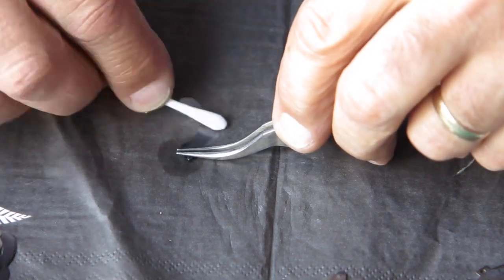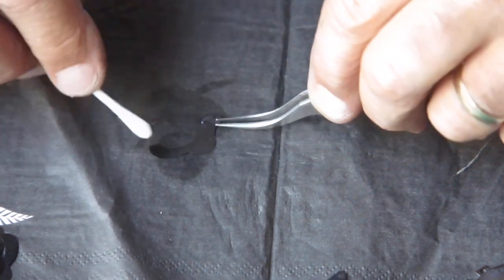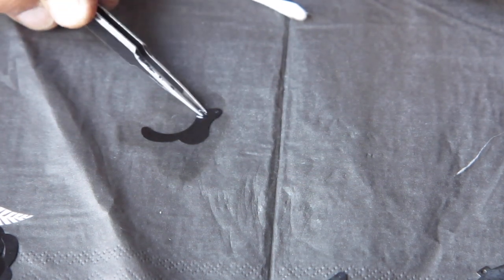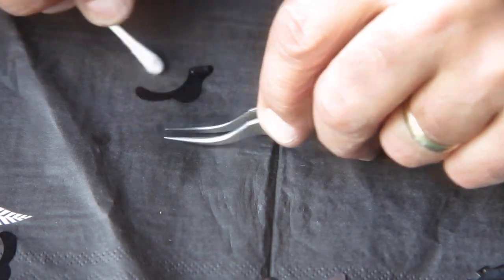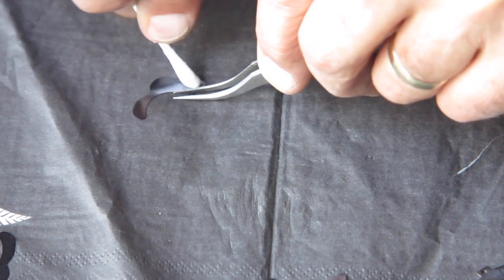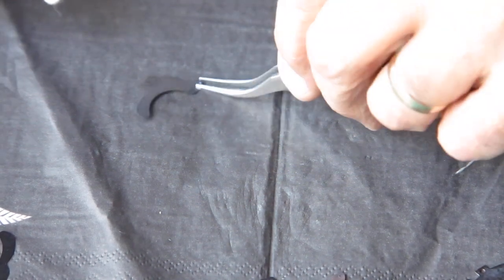Shutter blades are much easier to clean by comparison because they, generally speaking, are dead flat, and have no rivets on them. Put them down on the surface and you can polish away on them to your heart's content, and they are typically not so easily damaged as diaphragm blades because they're not such a funny spindly shape. These blades are in good condition, they don't need extra care apart from cleaning.